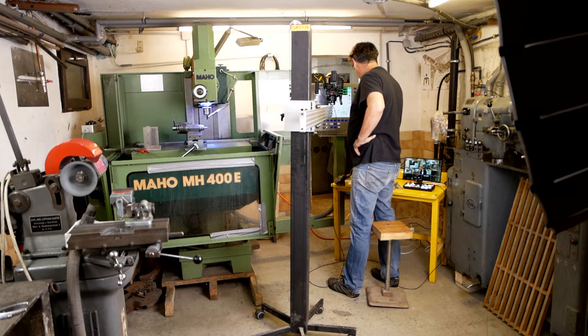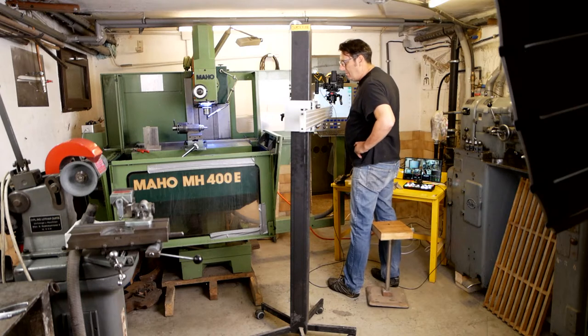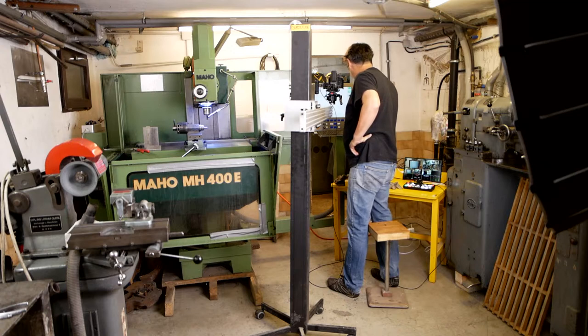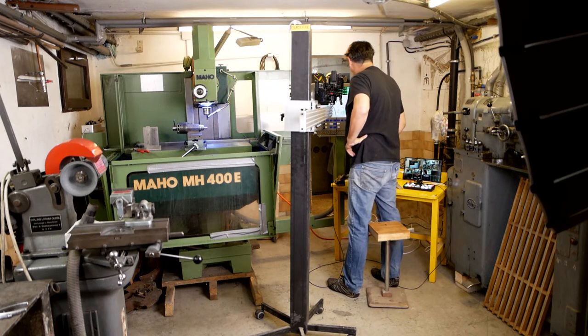This here, if we go in and edit it, it's only going down 1.2 millimeters, but let's just halve that for a first cut. Z minus 0.6. And at the moment it's climb cutting, so maybe it'll help with the loads if I change the direction. So if it goes from minus 10 to plus 10, rather than the other way around. Let's try that. Save that. Okay.